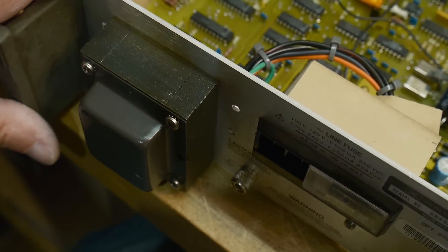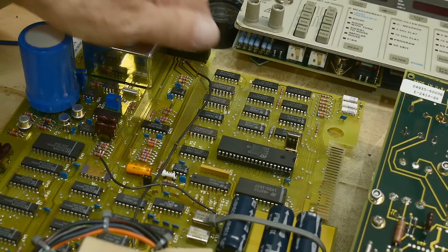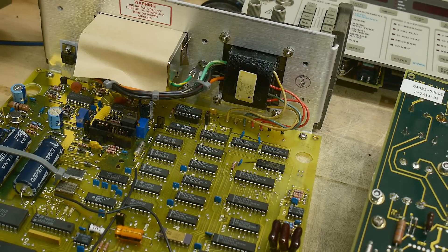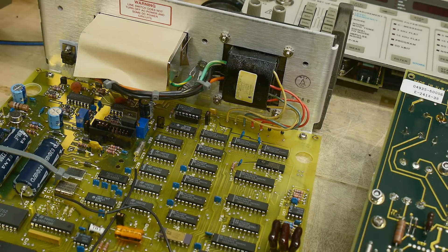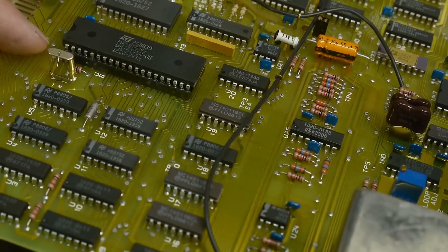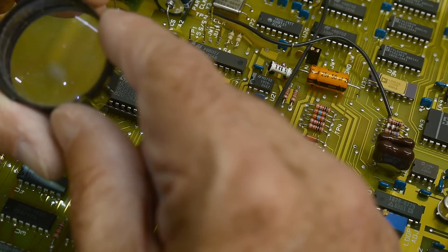Let's start over here on the digital board. Here's the analog supply, here's the transformer poking out the back, comes over to some filter capacitors — all old school stuff. Here's our microprocessor. Let's flip this thing around — of course it's all gold-plated Hewlett-Packard PC boards from the good old days. Let's see if we can get some date codes here: 88, 87, 88, 87 — somewhere around 1987–1989. So what is the microprocessor of choice?